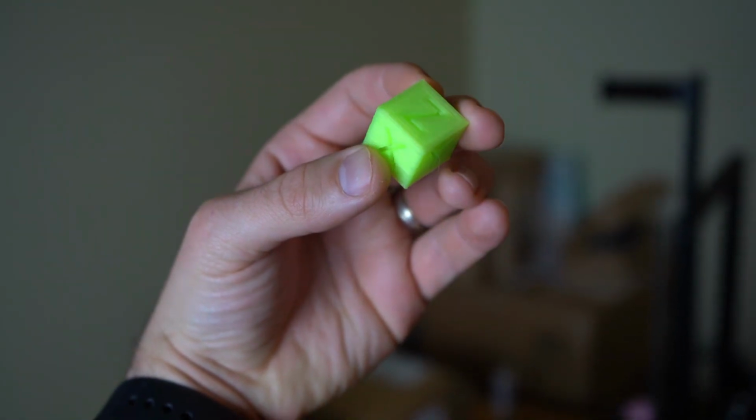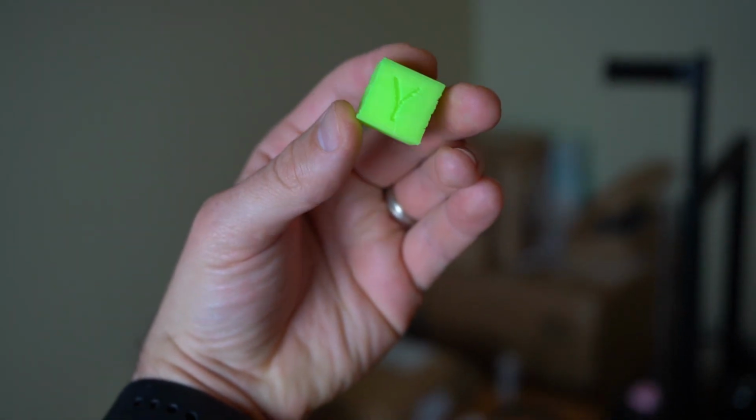It wasn't. Even on PLA, my prints were under extruding, brittle, and ugly. I disassembled the entire hot end, cleaned everything out, replaced my nozzle, calibrated my extruder's E-steps, and was still getting poor and unusable results. Even though my PTFE tube was fairly new, I believe that it was clogged. I saw much better results after changing that out as well, but I was still getting what looked like layer shifts, but only on the back of the Y-axis.